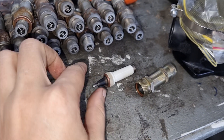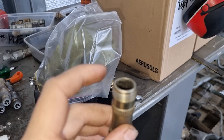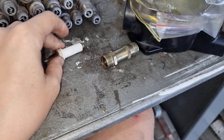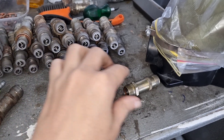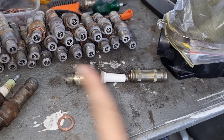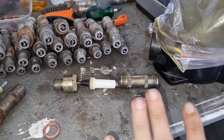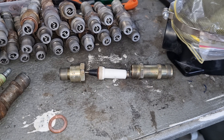These create a nice oil-tight seal, meaning in the slim chance that you get anything like water or oil leaking down the back here, it will not come through and affect this end. The electrode will still get into the engine - remembering that these plug directly into the combustion chamber. So if anything can get in from this end to this end, it gets into the engine, specifically the combustion chamber, and we don't want that, especially water. And because these normally operate in an aircraft engine, you cannot have such silly little failures, which is why they are, quote-unquote, over-engineered.